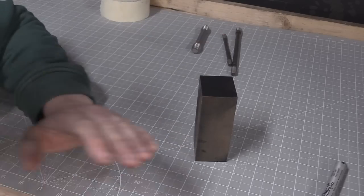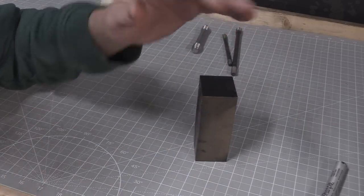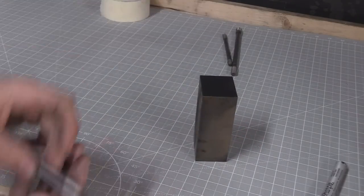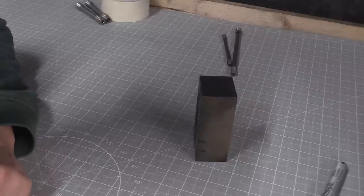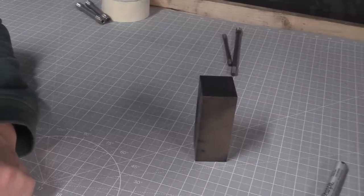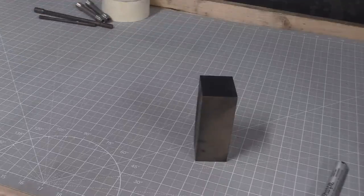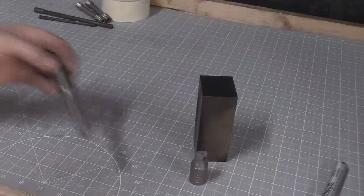You can give this information to your customer saying, right, it failed here. And you'll have a minimum, right? You'll say, well, I want it to fail at whatever. And you can also do different temperatures. So you can heat this up and pull it, because it depends what operation you've got. You know what I mean? Things start to get funky when you start adding temperatures to them and so on and so forth. So, putting this to one side, I have some samples of broken ones, ones that were tested, ones that were pulled.